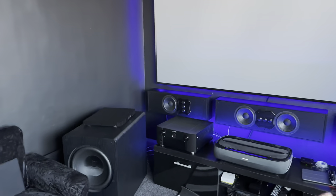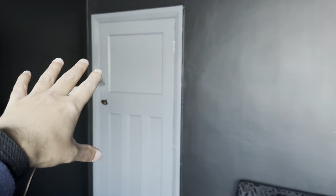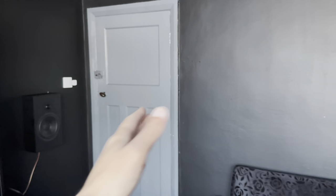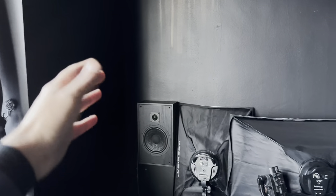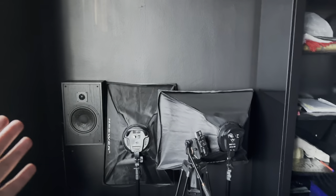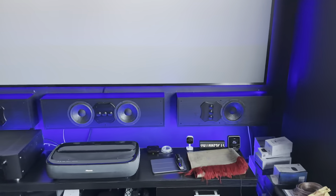Possibly along the bottom of the front wall as well. If the sub stays in this corner I'll probably need some bass traps there. If I relocate it I'll do bass traps in the front two corners instead. Because of everything going on here with the speaker and the door, I've always had a boominess issue from this corner — even with a soundbar there'd always be bass reflection coming from that corner, so it definitely needs treating.